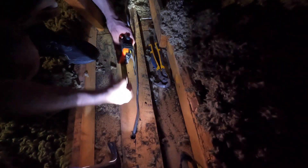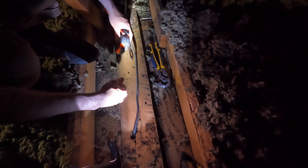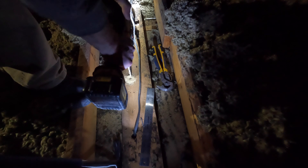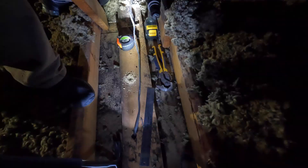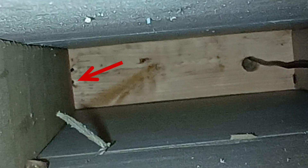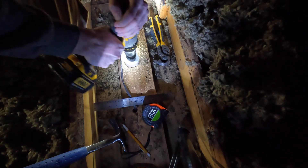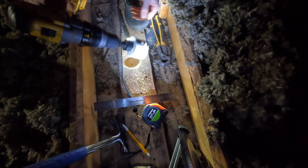I had to go buy a longer 1/4-inch bit because there were three 2x4s on top, but my 10-inch estimate put me in a pretty good spot. However, the Romex hole was not drilled square and so it was not exiting in the center of the wall. But I could look up from the basement to see where my holes were coming through, which took a lot of the guesswork out of it. Once I got my spots, I drilled through with the hole saw. I hit some nails, which I either cut through or pulled out, and in the end the holes were good enough.